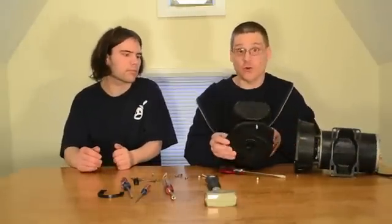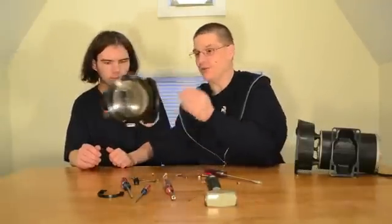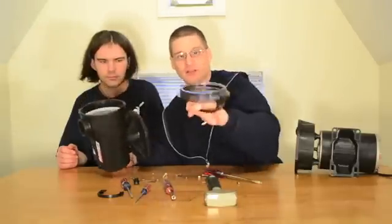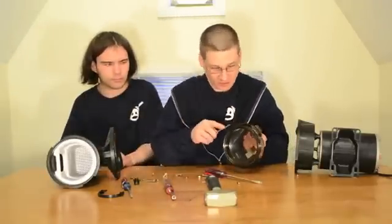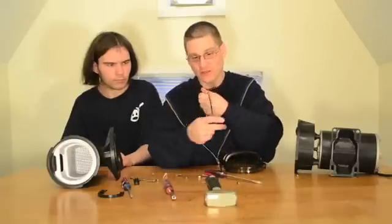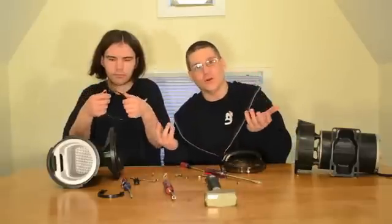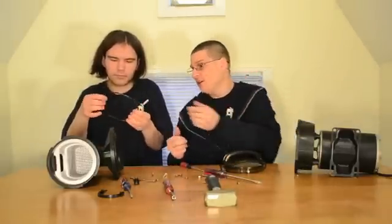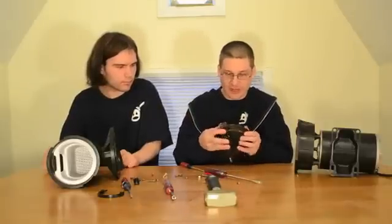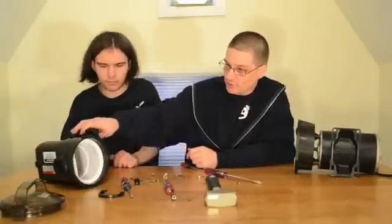This part is called the volute — the wet end of the pump. Remove the two bolts from here. This is where your pump basket is, so open this up and take the cover off. Take a little flathead screwdriver and pop out the o-ring. You want to do the stretch test on this o-ring — give it a pull, and if it breaks, it needs to be replaced.